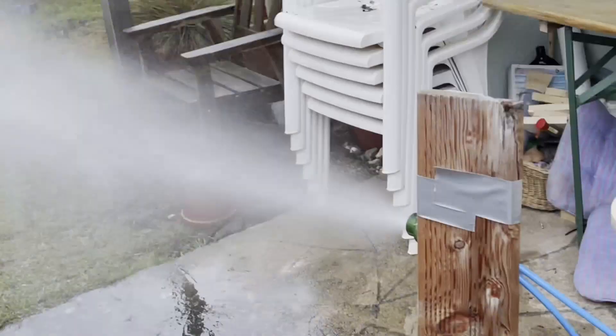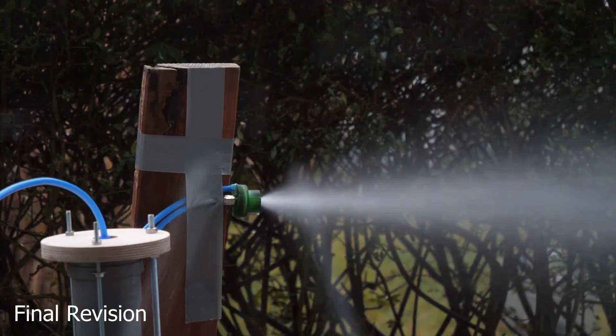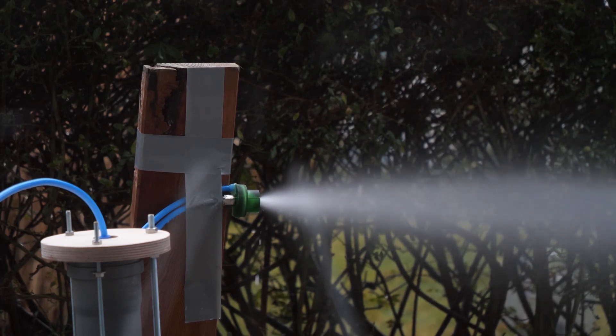The outlet streams look pretty nice, right? The problem: we had a mass flow of over 100 grams per second of ethanol and over 2 liters per second of gas. We as professional rocket idiots would think this is too much for a small engine — and finally our target engine RAV-C has a flow rate of roughly 60 grams per second.